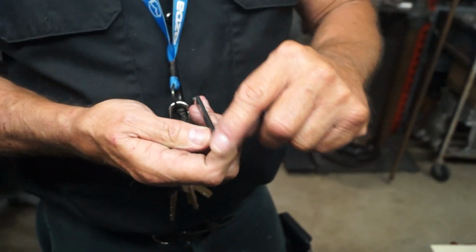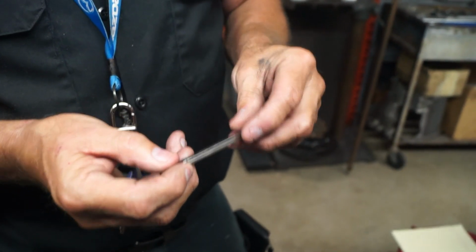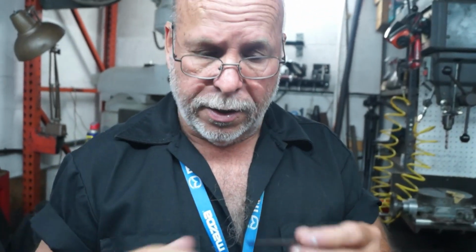The reason why I'm telling you this is because we've dressed the seal to reuse it again. But look at the difference. It's more than half. Wow. So strength-wise, this seal is going to be 10 times stronger and more rigid than this seal. The reason why they had to do this is because they took the porting configuration on that RX8 engine so far out that it required moving the side seal on the rotor further out, and it required a smaller apex seal.